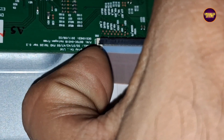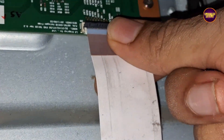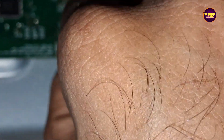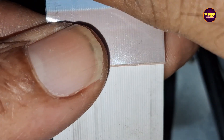These are the gate signal tracks from both left and right side of the TCON which enter to the panel through FFC cable. For repair, here we are implementing the taping method. First let us block the right side gate signal tracks — remove the right side FFC cable and mask the gate signal tracks using cello tape.